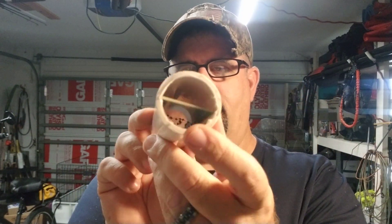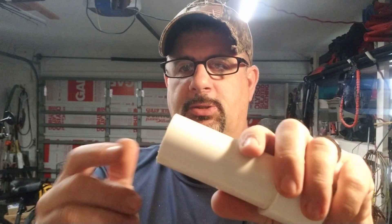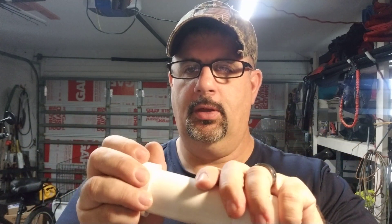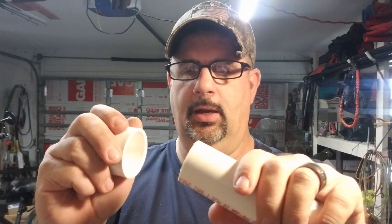Either way I'm going to leave one end open so I can take the antenna in and out. I may run a little bit of RG-58 or whatever and then put the connector down on that, so I can tape up the connector. The bottom line is it fits in this piece of pipe. Another pro tip — especially on something you're going to disassemble — make sure you smooth the edges of this pipe with a file or some sandpaper so it goes together easy and comes apart easy. Any of you guys that have worked with PVC know it can get jammed in there pretty good.